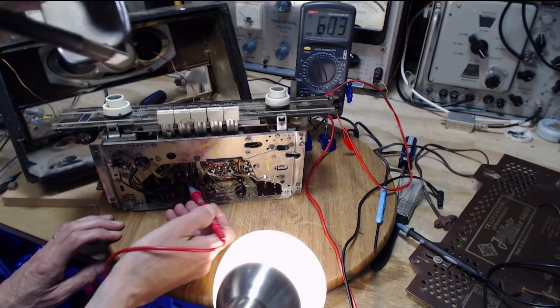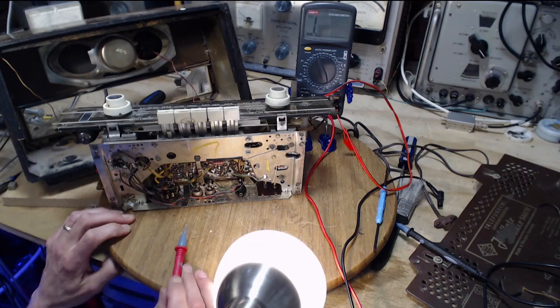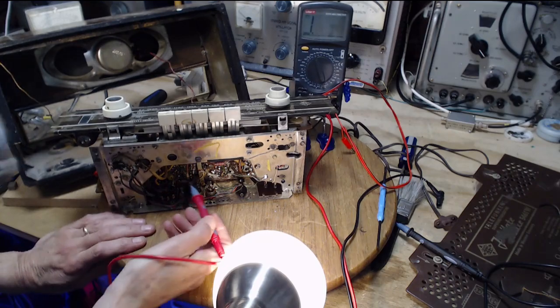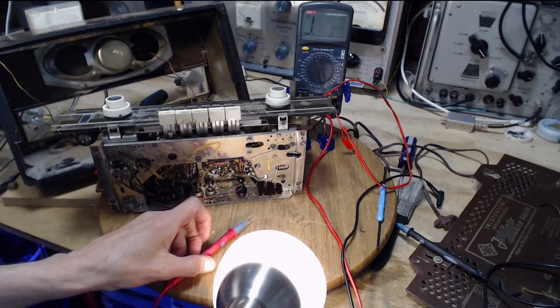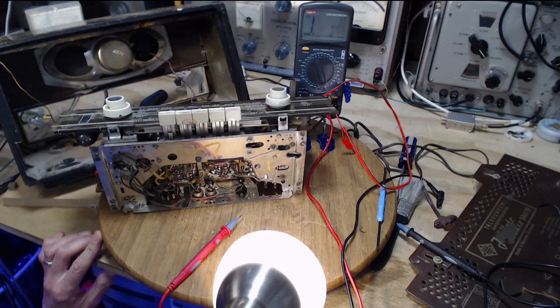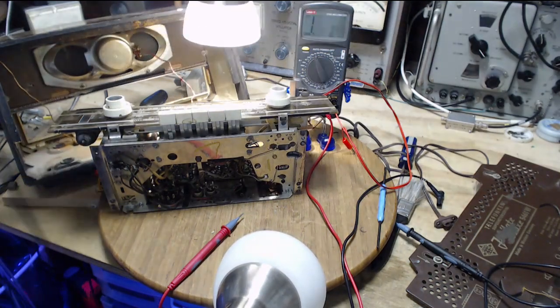So this resistor. So I have a long lead here to solder to, if I want to put the capacitor underneath here, which I think is probably what I'm going to do. Yeah, because this would be easy to stick a capacitor underneath, if I just find the other terminal, which I think I've cleared away, so there's a hole through the board. And I should be able to find that hole. Let's give that a try. See if I can do that.